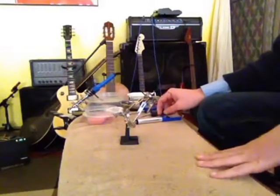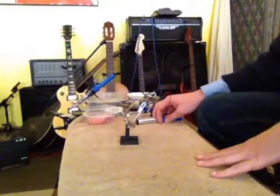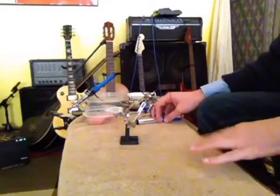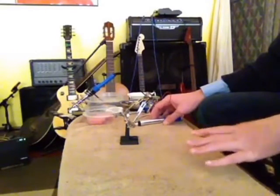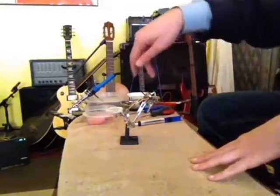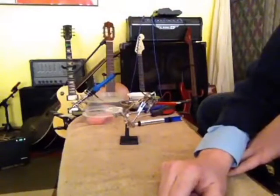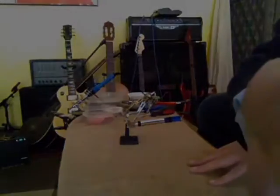But yeah, we're gonna take this apart, redo it, and get it nice and clean. We'll show you some clean joints, which should be shiny, and you don't need a lot of solder on top. You don't want to clog up your pot like that, because it just makes for a horrible mess. So again, Mantis and the Funk doing electronics today.